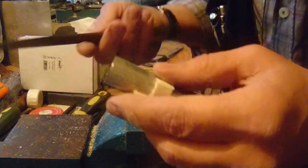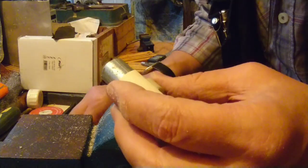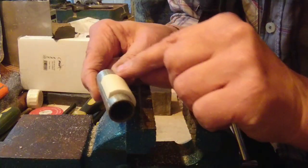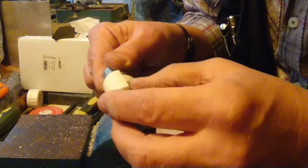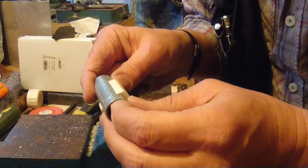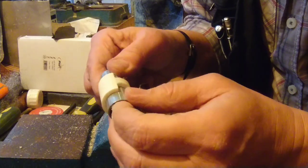It's just a case of finishing it. I've got a smaller half-round file here but the same grade. I'll finish my shaping with those two files and then rub it down first with a medium sandpaper, file the sharp edges away to make it all nice and smooth, round the corners and everything so there's nothing to damage the flute or catch your fingers. Then I'll do that with the files, sand it, and finish with some finer wet and dry papers to a fairly nice surface finish.